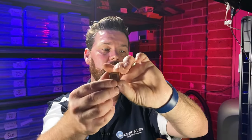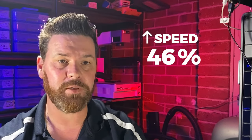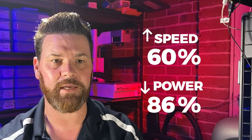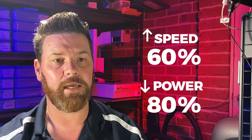Here's the finished little item that has just got engraved. We'll show some little pictures at the end anyway. You'll just see a photo of this little pre-cut test square. You'll notice that the sides are just a little bit too dark, so I'd probably back those settings off a little bit. Their pre-made setting is a little bit overboard, but we'll back them off, make a nicer edge, and fine-tune our settings later on. But just straight out of the box with their pre-made settings ready to go — still does the job.